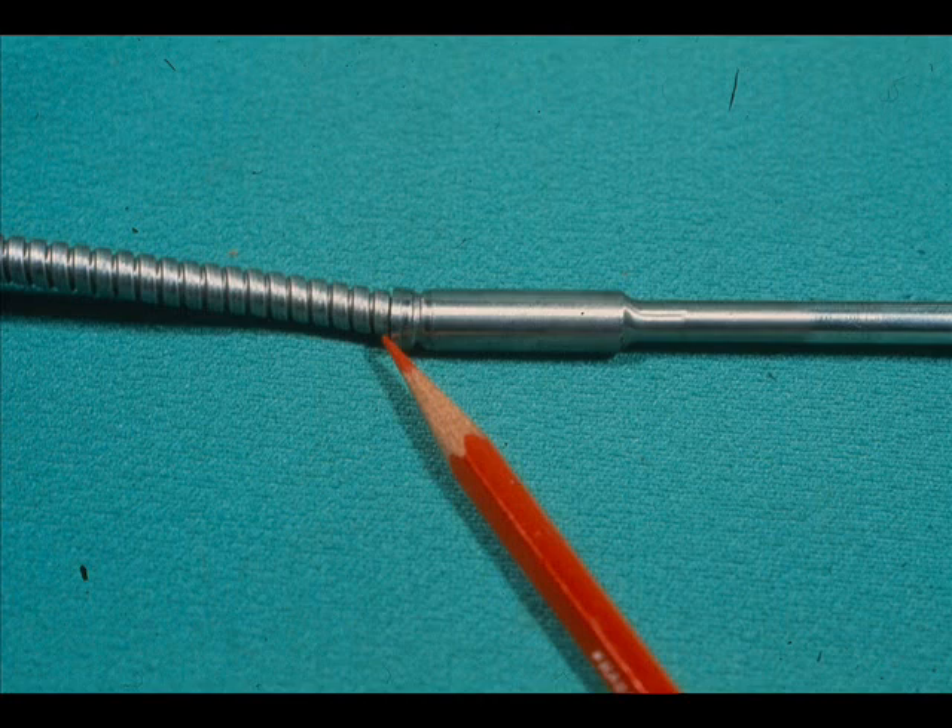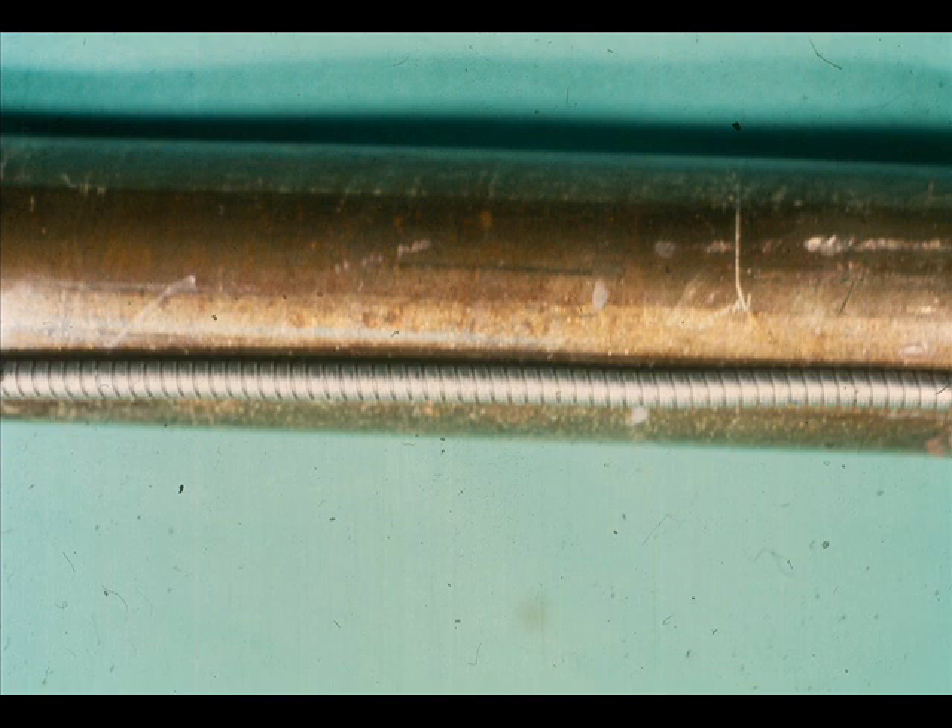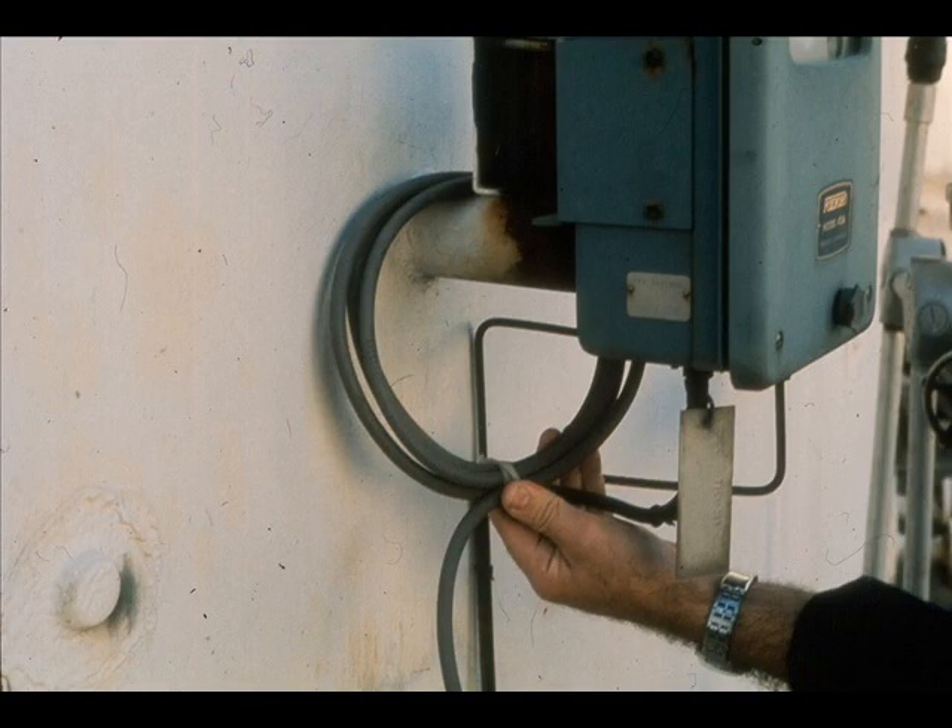One of the weak points is right where it comes out of the bulb. Be very careful not to bend the tubing too sharply or it will kink. Avoid subjecting the capillary tubing to extremes of heat or cold, as this makes ambient temperature compensation very difficult. Coil any excess tubing and tie it up behind the receiving instrument, out of the way.